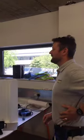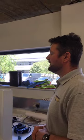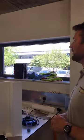Okay, so we just had a quick question being asked about it could potentially damage the surface underneath when we're carrying out the repair. We'd only recommend doing repairs on high energy surfaces. The potential with a low energy surface like a painted wall is that whilst removing the material it could bring the paint away from the wall as well. So that's just a consideration to make whilst you're trying to make the decision as to whether a repair of this type is the right option to use. The other option that you've got is to put a full new piece on over the top.